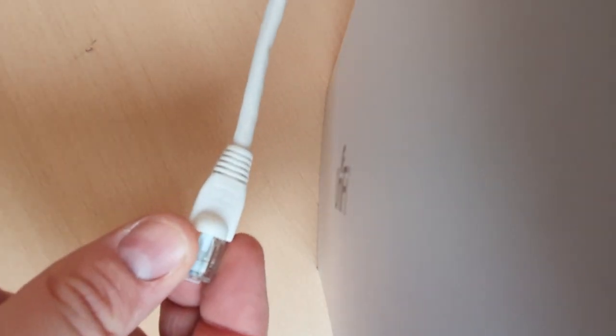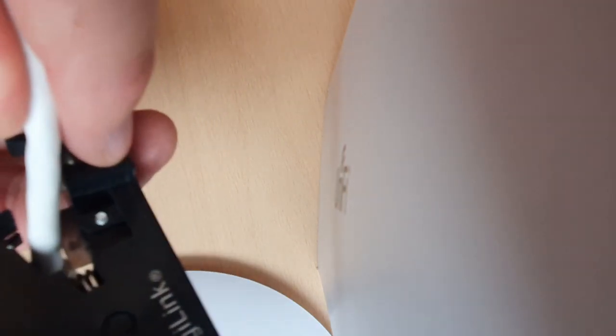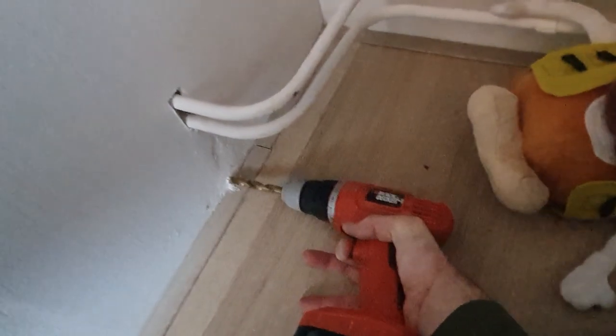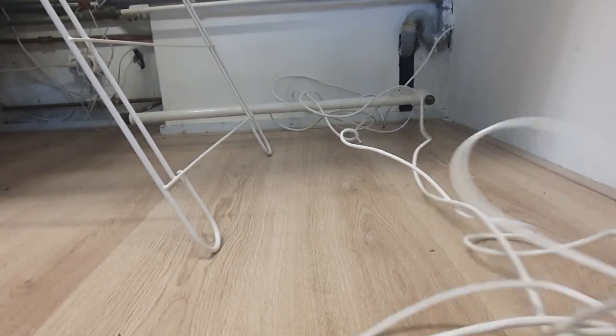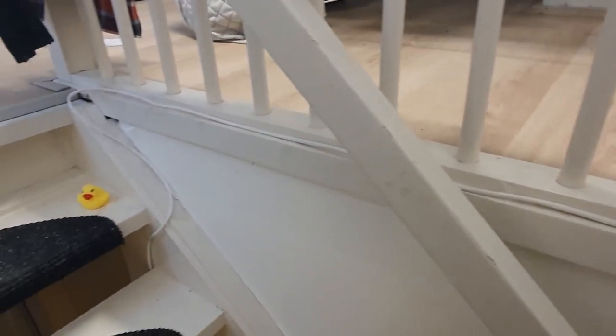Since I will be going through a wall with my ethernet cable, I will need to drill a small hole, and I want this to be as clean as possible. So I will be applying my own connector at the end, keeping the hole as small as possible. I started out by cutting off the existing connector from one end of the CAT5e ethernet cable. Use at least a CAT5e cable to ensure a fast WiFi connection, since ethernet cables from category 5e and up allow for up to 1 gigabit connections. Now it is time to make the way clear from your switch to where you want your access point to be — for me this means going through a wall. Then I run the wire from the PoE adapter through the wall towards the bottom of the stairs on the first floor, and cut the ethernet cable at the exact length needed.